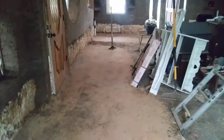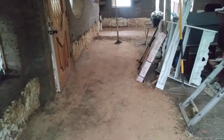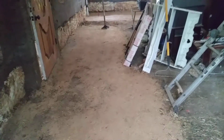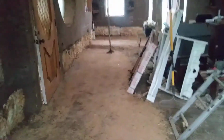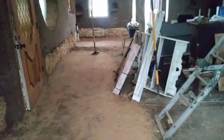It looks different. Caliche is typically a tan color, much like limestone, and it's got a little piece of rock in it. This one's probably more of a manufactured, but either way, it's a base. It's a 3/4 inch to 0. It's comprised largely of little bitty rocks, some sand, and quite a bit of clay. And it's used as a base for different types of foundations, roads, that kind of stuff.